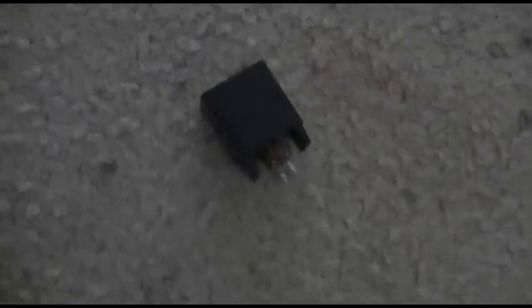I'm putting a degaussing coil from a more modern set down in here. We'll use the thermistor that modern sets use in series with the coil, and then put a switch — like a push-button switch — to manually degauss. Here's what it looks like with the safety glass PVA material removed and the cataract cleaned up — or as most people would call it, the mold cleaned out of the screen.